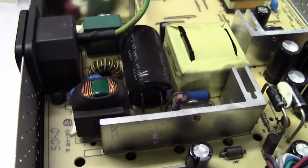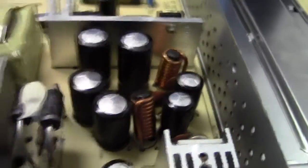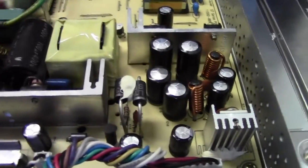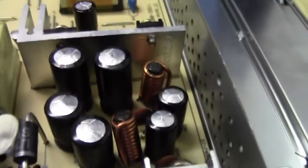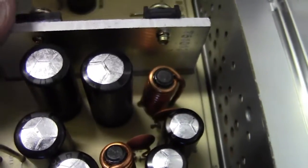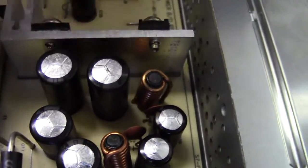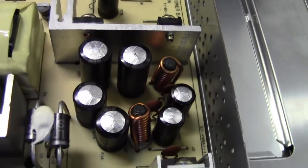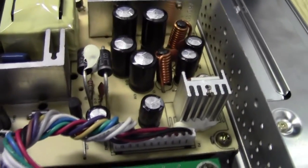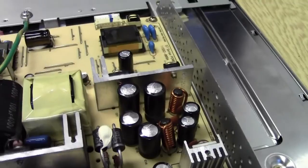it's a larger one here for smoothing on the actual power supply side, on the main supply. This one here, after it's all been regulated down, so it looks like it's regulated down and goes off to this edge connector. These are all quite knackered, as I said. You can actually see on these large ones, you can actually see this on the centre. I wiped it off on this one, unfortunately, where I was showing you, but you can just about see the little brown blob creeping through. That's the electrolyte and the actual cap slowly venting out. These ones all go the same way because they're bulging, and yeah, they're the culprits, so we'll swap those out and hopefully we'll get a working screen.